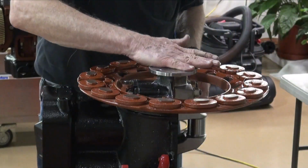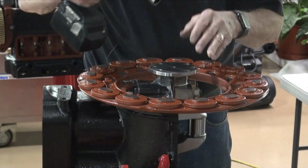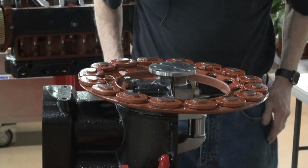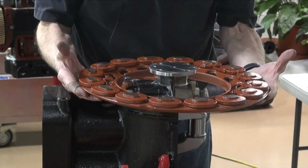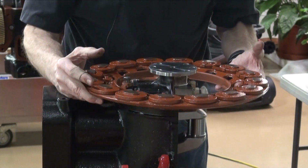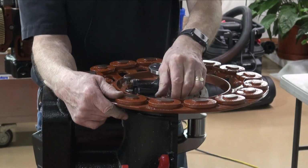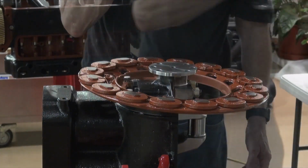So on the next step, we're going to loosen these bolts, leaving the shims in place that we've got, because we know if we tighten it back down, it will still be level. Then we'll install the flywheel with magnets on it. Because the magnets are right in here, this will suck the field coil up to the magnets, and then we're going to measure the gap that results, and then we'll do a quick calculation to say how many shims we need to add at each one of these locations. It should be the same all the way around since we've made this level, but we'll check and see.